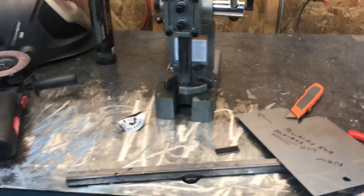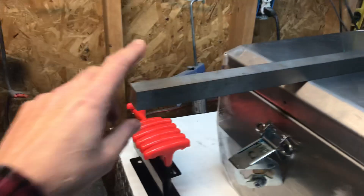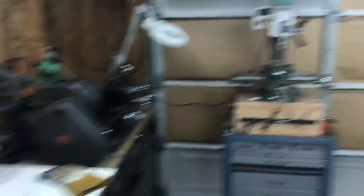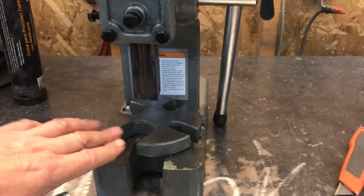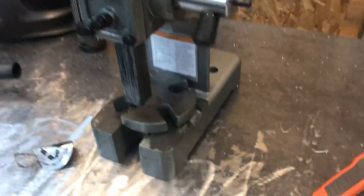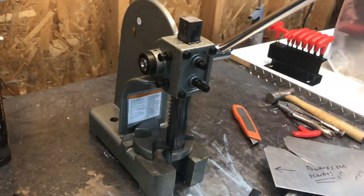What I'm going to try to do is make some punch and dies. This is tool steel in its annealed state, so it's soft — I can actually mill this over there on the mill. What I'm going to try to do is make a triangular-shaped piece that sits on the bottom of the arbor, and I'll have to make the receiving part down here to hopefully make a punch. This is a one-ton arbor, and I've never tried doing anything like this, so I don't really know how it's going to go. But I do know that on this machine over here, it doesn't take a whole lot of force.